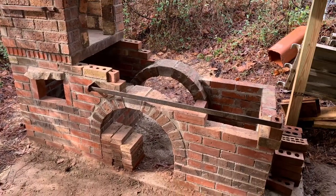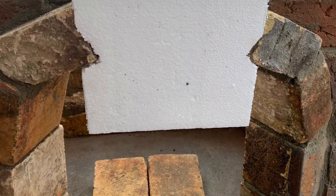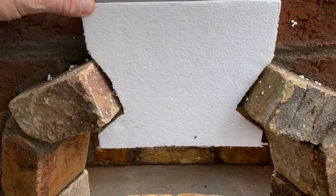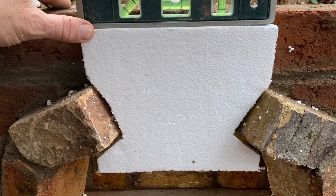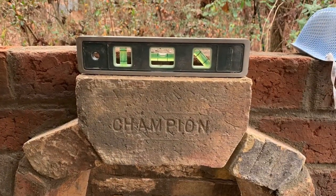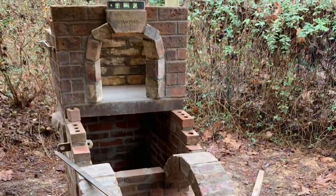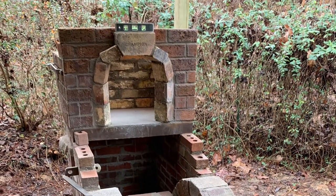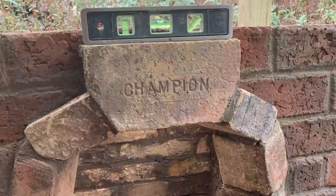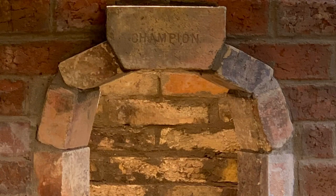This required laying a couple of additional runs of brick. I started the keystone by getting a piece of styrofoam and cutting out the angles and the size for the keystone brick. I then transferred those angles to the brick. Using a diamond blade, I cut the brick into the appropriate size and angles and then affixed it to the front of the forge in keystone fashion with mortar. It turned out very well, possibly even better than expected.